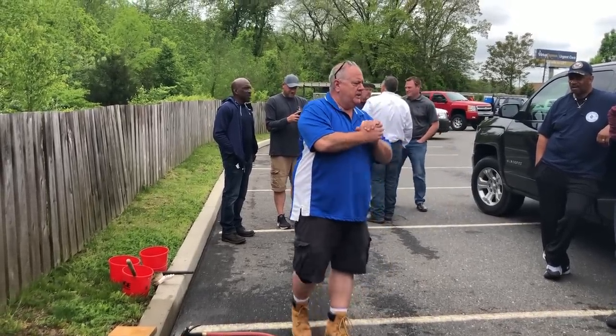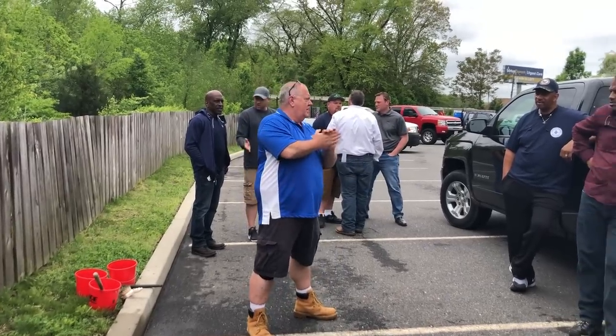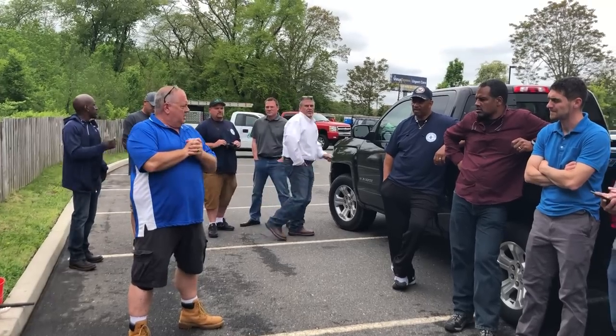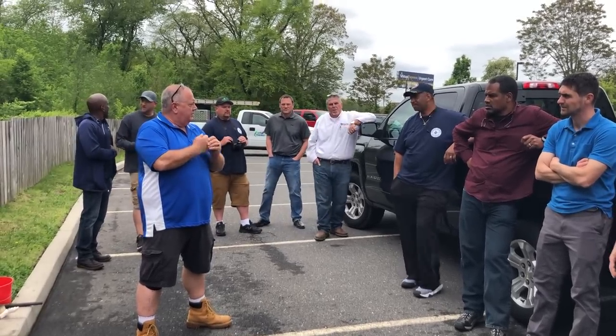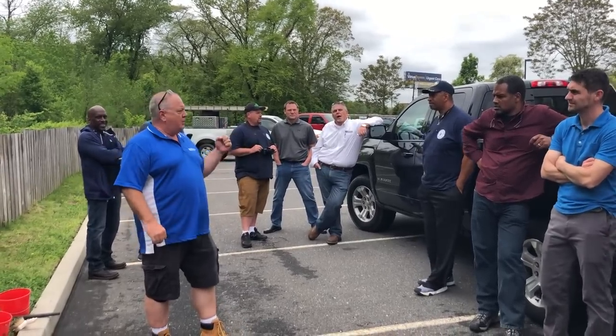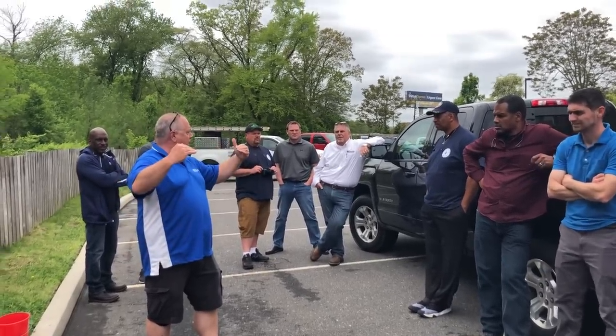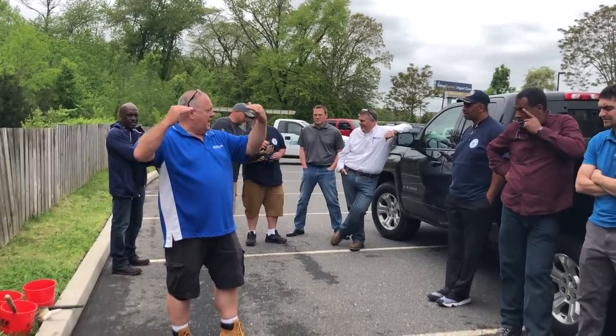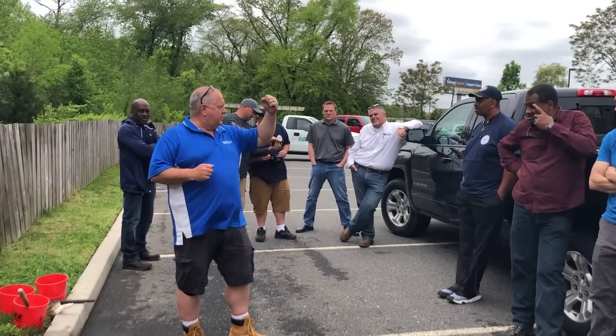All right. Anything else? What about on the cabins? Any of the same stuff? It's the same way. Yep. No different. The only difference between a vertical surface and a horizontal one is you have to keep it wet, and you may have to reapply. So if you get to a 30-minute or 45-minute dwell time, you might have to reapply because it's coming down as you're misting.